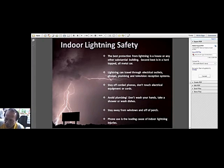If you have that, that would be the minimum, and then these two ground rods should be bonded to other ground rods. Yes, as much as possible. No? Not the ground rods that are used for the electric grounding of the electrical system, okay? Because the ground rods which you use for lightning protection should be independent of the other grounding system. You see, you have a grounding system for your electrical distribution, and you have a grounding system for your communication. So you must also have a separate grounding for your lightning protection.